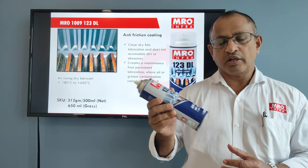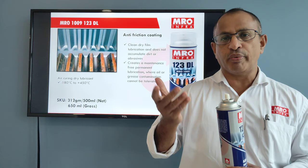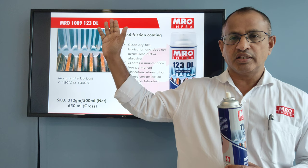After that, give it three coatings at an interval of six minutes each, so that solvent entrapment doesn't happen and the solvent should evaporate before each coating is applied.